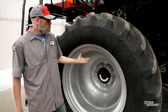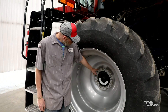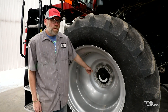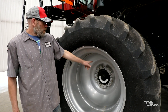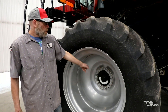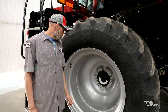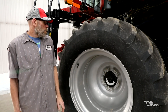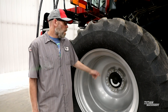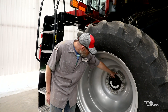What will happen is your tire will actually fall off the machine. For torquing these, if you have the 20 bolts they want them torqued to 1,000 foot-pounds. If you have 10 bolts and 10 studs, torque the bolts to 1,000 foot-pounds and torque the studs to 600 — the book says 550 but I always go to 600 on the studs. If you have the 20 bolts like this one does, they're all torqued to 1,000 foot-pounds.